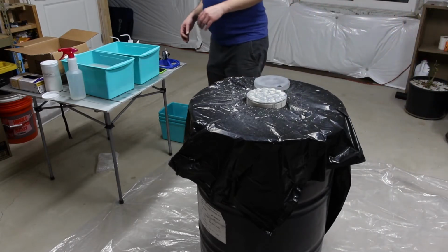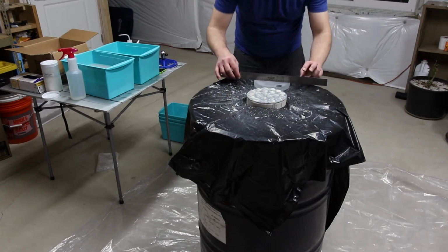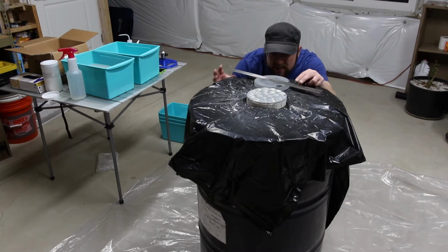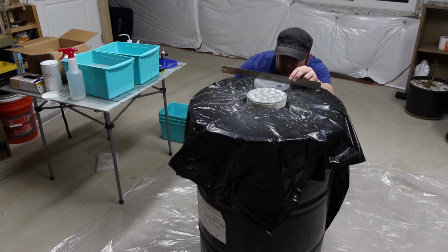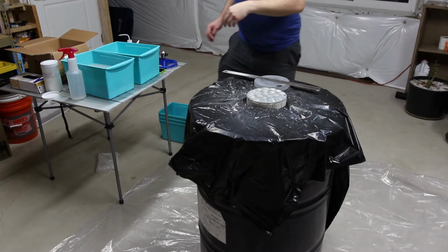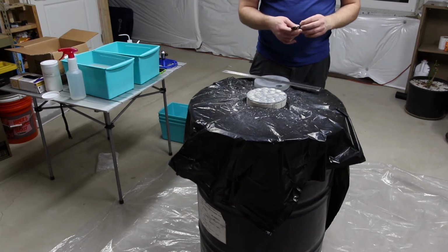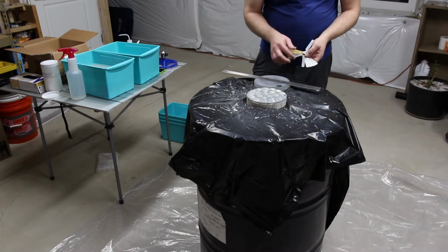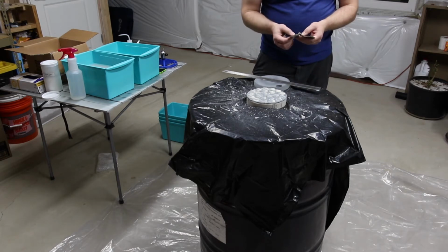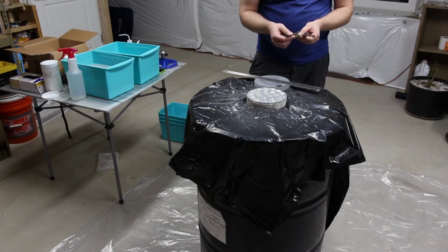Going 3-4 inches across. So I grab my handy straight edge here. Look carefully. I can definitely see that there is a gap underneath there now. It's kind of deepening in the center a little bit. And I can use my feeler gauges. For a 6-inch mirror, we're looking for about 47 thousandths of an inch deep. Using the numbers on my feeler gauges, I can figure out what that needs to be, and I can see where I am right now and how far I have yet to go.